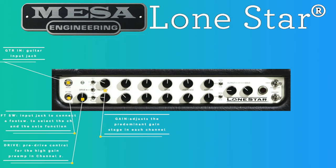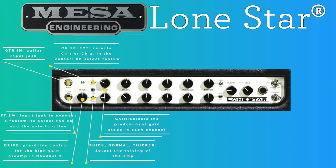Then we have a 3-position mini toggle that allows manual selection of the channel when the footswitch is not connected — it should be set in the center to use the footswitch. Then we have the Thick/Normal/Thicker 3-position mini toggle that allows you to select between three different voicings, selecting what frequency the treble control will enhance. Normal is the best choice for traditional blackface-style clean or clipped sound. Thick lowers the frequency of the treble region while keeping the gain closer to the normal setting — think of it as a plexi switch for classic-style response. Thicker lowers the treble frequency even further and adds considerable gain in that region.